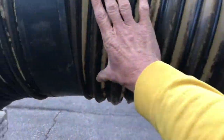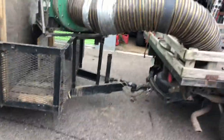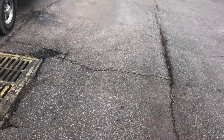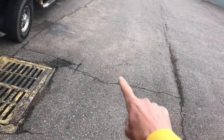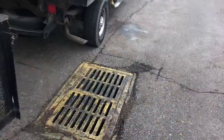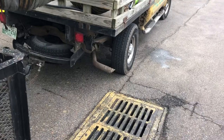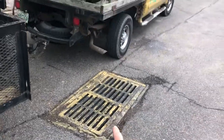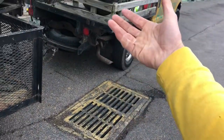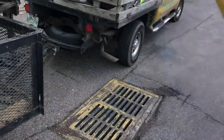This hose needs to come across and then hang straight down, because if the hose is down low and runs out sideways like a lot of guys seem to do it that way, the debris bumps along and gets stuck along the bottom and falls out, and then the air can't suck it through. All that resistance along the tube's inner wall is what slows it down. But picture the inside of the tube going straight down — the air is just underneath whatever it is, all it does is lift it the whole way and it doesn't bump along any sidewalls at all, nothing really slowing it down, just air underneath it lifting it up.